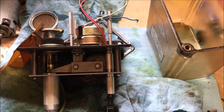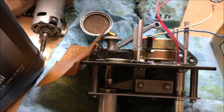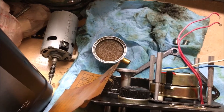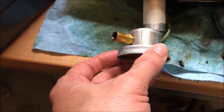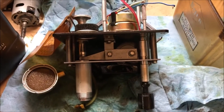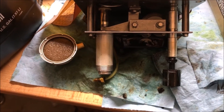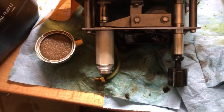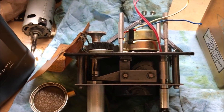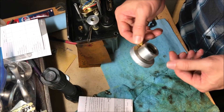I've taken the oil pump apart. While I was working on it, I decided I'd better check the filter since this has a filter on it. That's the filter right there — it normally fits right down at the bottom. When I took it apart, the bottom of this canister was about an eighth of an inch thick in black sludge, and there was black sludge all over these surfaces. I cleaned it all off — sorry I didn't get video of that — but it's all cleaned up now. I've ordered a new filter.